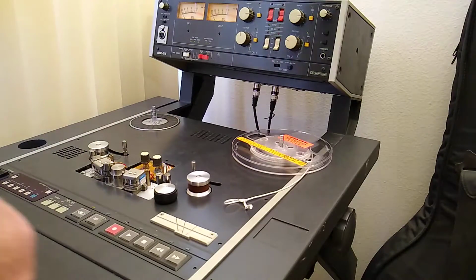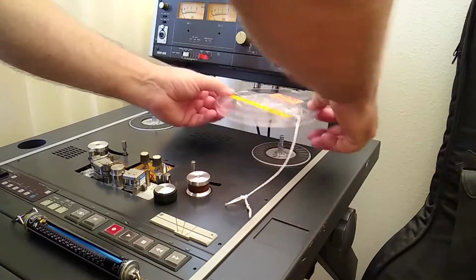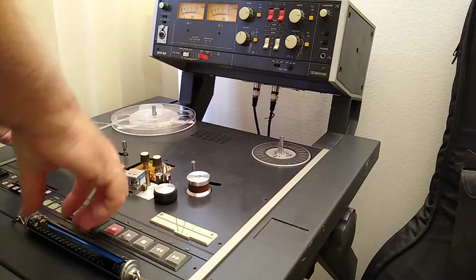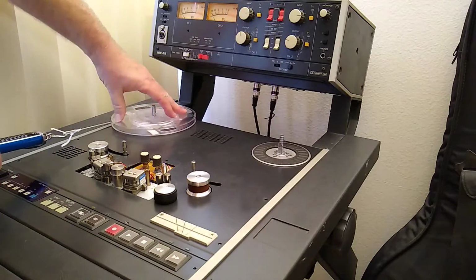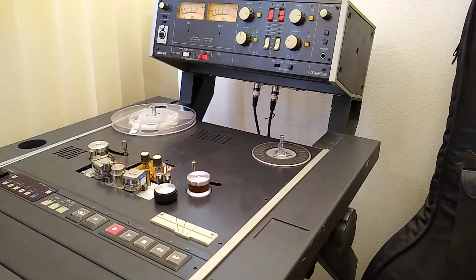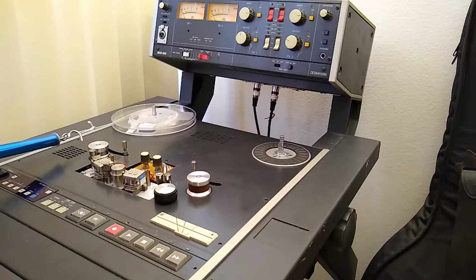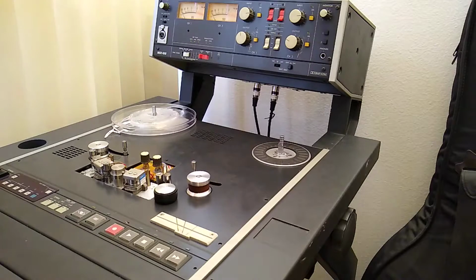So let's test the other one. So that's too, the brake is too tight on there is what that would mean. So let's check this one. That one was clockwise. This one's counterclockwise. See what this does. Much the same story. That's moving at about 5. Actually, that one's going over 2. So that's also 2. The brake is too heavy.